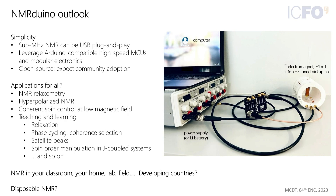Another audience member asks about digitization — is it done directly on the Arduino? The answer is that it uses a separate ADC chip. As time goes on, you can find the right chip that offers a higher sampling rate or is most compatible with the microcontroller's communication protocol. The microcontroller has limited memory, but it's sufficient for sampling tens of seconds at 10 to 100 kilohertz speeds.